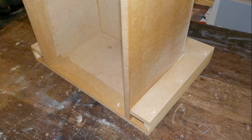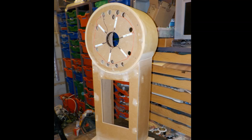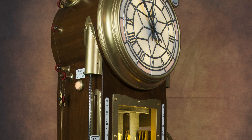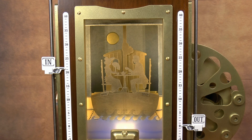The rest of the enclosure I made from 12mm thick MDF, just glued and butt jointed at the corners. To finish the surface, I applied wonderful self-adhesive veneer. It's great stuff because it sticks instantly — you have to press it down really hard, but it's permanent, and then you can stain it, varnish it, whatever you want. But it looks lovely.